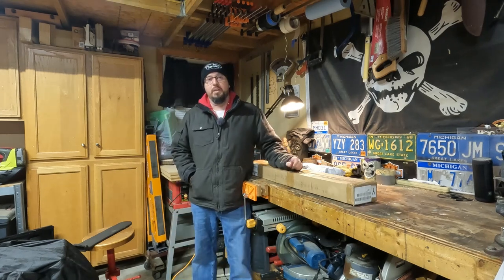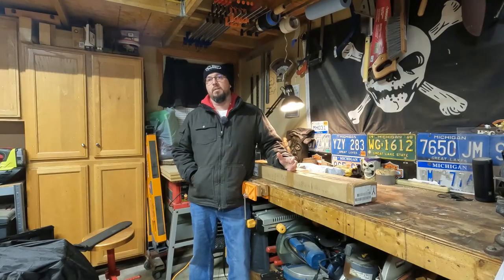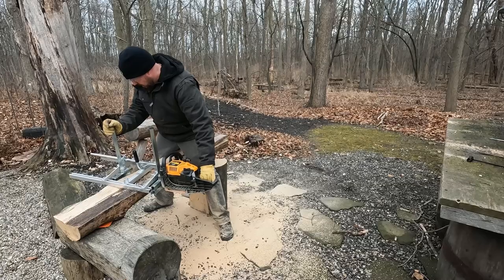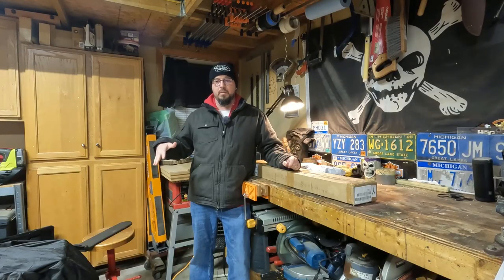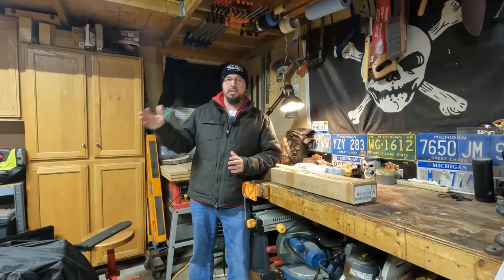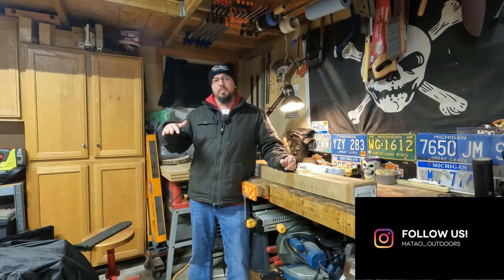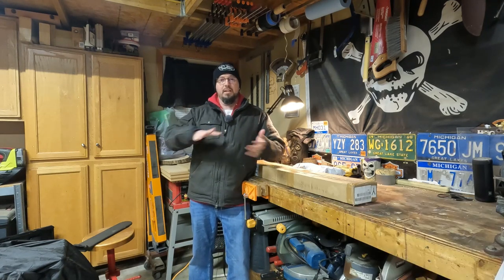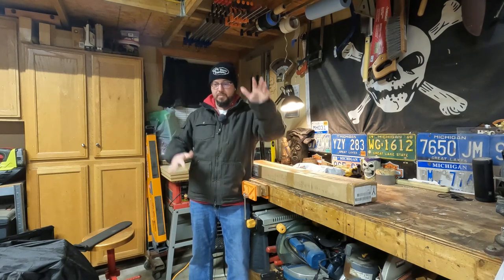Okay, so in the previous video, you saw me build the chainsaw mill, and then in the next video, you saw me try to mill out some lumber. It was a horrible mistake. Basically, what I did was I split the log down the middle and used the natural split as a guide to run the chainsaw on. That was a problem because the natural split was not smooth and flat and level. It wobbled and had high spots and low spots.